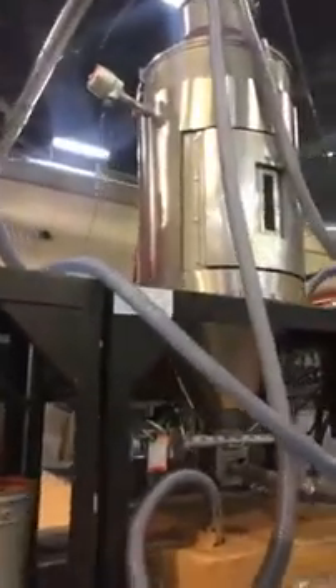As I walk around this machine, we have a dryer system to dry our pellets, which is what these systems use. Basically, the material comes in these Gaylords, gets sucked into the dryer system, and gets dried for a period of at least four hours.